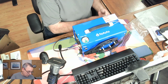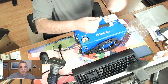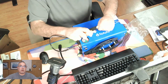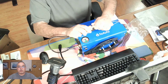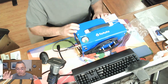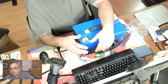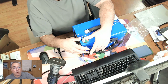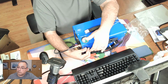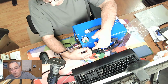Okay, let me show you what I'm doing here. I got the little bag of goodies here. I got a test plug. I got our filter here. Whenever you're putting this in, guys, always make sure these collars lock. It really is no fun when these things pop off. All right. We're going to start to 2,000 PSI. As always, when you start up a compressor, make sure your bleeder is open. Don't try and start it with the bleed valve shut. All right, let's see what we got here.